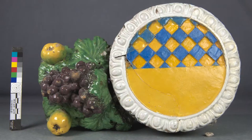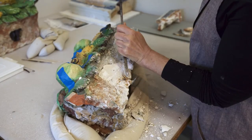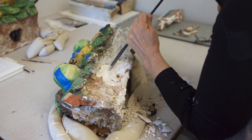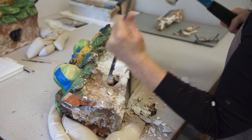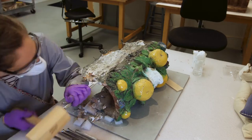The full extent of damage and instability in the plaster mounting materials became evident at this time. Therefore, we began removing the old hardware and cracked plaster from the original terracotta using mallets and chisels in a slow and controlled manner, as shown here in a condensed time-lapse video. Removing the old mounting materials was essential for providing us further access to the tiles and aided in subsequent conservation treatments, such as when we discovered a complete loss to the original terracotta in one border tile.